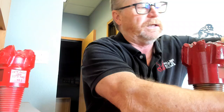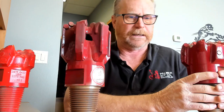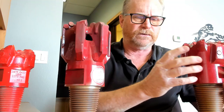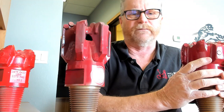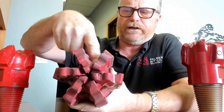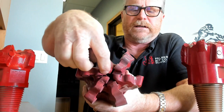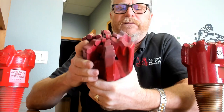Comparatively speaking, here is a wing style for a hard formation. We've got a six-blade hard formation bit — this is for your limestones and similar formations. But if it's an extremely fractured formation you can go to the full body again. And if it's really hard dolomite, hard fractured limestone, or anything like that, they also make a matrix body — it looks extremely durable, it's a very hard body for the very hard, nasty, fractured formations. Back to the blade type: it's a six-wing, you've got large areas for your cuttings to get past. Your circulation ports are on the side, protected by the nose. You even have a very small circulation port right down the middle to blow the cuttings out and continue to drill along with it.